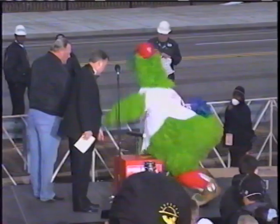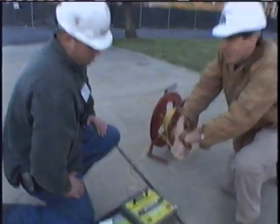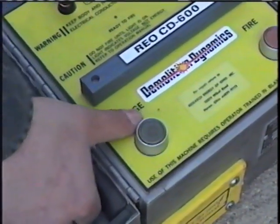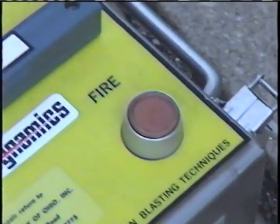It's not connected to anything — let me show you the real one. It's almost go time, and this isn't what most people envision. They think of the old detonation like that on the cartoons. This is a special box. It's connected to just one wire. This one lead line ties into our nine electric detonating caps that start our whole series. It puts out 600 volts — plenty of juice to get everything started. What we have is a charge button and a fire button. Push the charge button and it'll juice up the capacitor. When that light comes on ready to fire, all it takes is a push of this button. It takes about 10 to 15 seconds to charge up at the most.